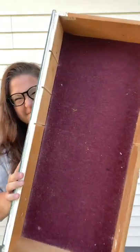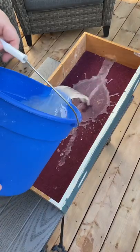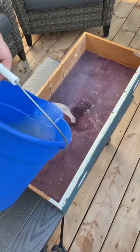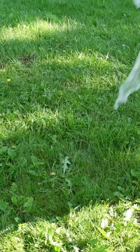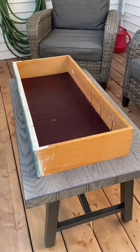If you've got some old furniture drawers with that gross felt in the bottom, here's the method that I like to use to get rid of it. I fill the bottom of the drawer with tap hot water and then let that soak into the felt. Then I dump out all of the excess water and let the wet material sit there for another 10 or 20 minutes.